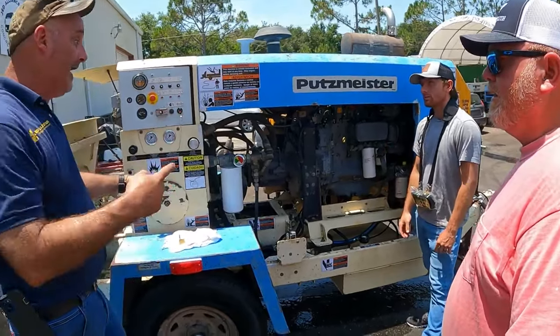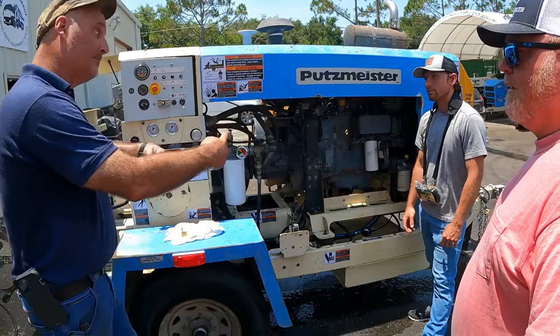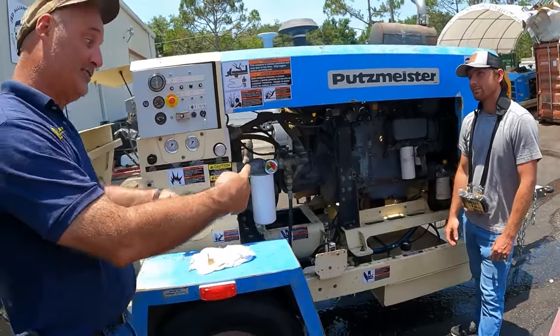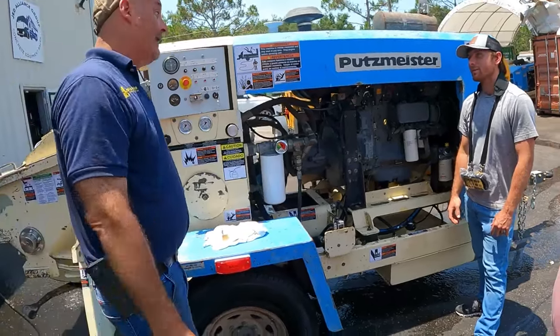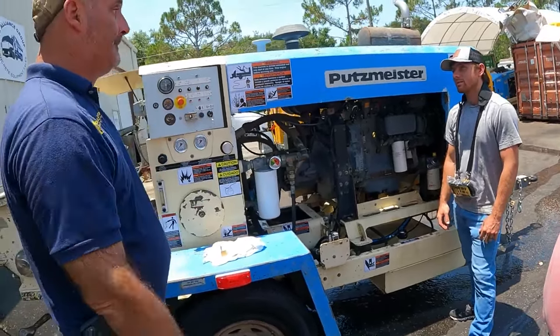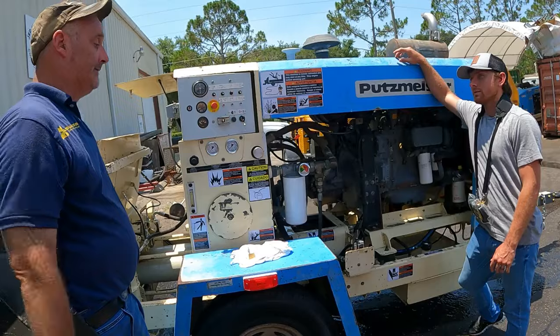So if that oil isn't enough, when that piston goes all the way down, it doesn't have any oil to bring this all the way up, it stops. Now you're short. So the next time, you're getting shorter, shorter, shorter. You gotta always add oil. So adding oil is a lot easier than taking oil away. So that's what you're doing, taking oil away and pressuring it out.